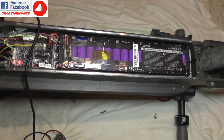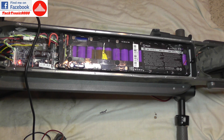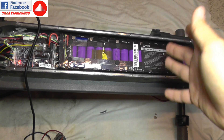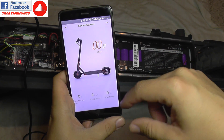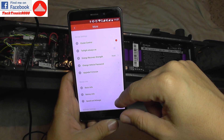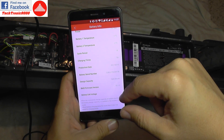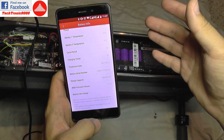The battery is back alive — it has been reactivated. There's a red LED here so it's charging. If I were to disconnect and measure it, I'd expect around 40 volts, meaning the battery is working again. I won't disconnect it again since the smart board would disable it. Let's see what the mobile application says — connecting the device now. It has connected successfully: current battery level is 99%.